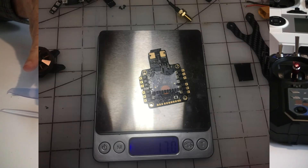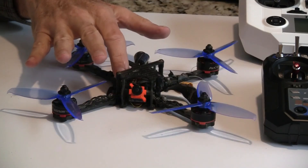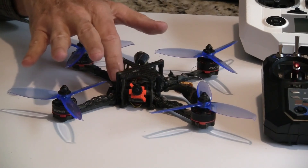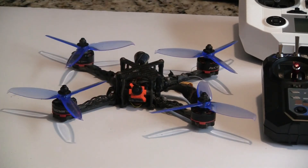A couple of delays as I switched out the Flight Control ESC all-in-one board. I'll list it in the description below, but it's called a — I got it from Ready to Sky. It's a Flip 32 F4 all-in-one Midgard board. It was fairly inexpensive, $43, but I picked the wrong board. I should have picked one with the OSD built in. This one, you could add an OSD by adding a chip. So instead of putting an OSD on this, I just switched out the camera to a Micro Swift with OSD on it, so at least I got the voltage, the run time, and the name of the model on there.